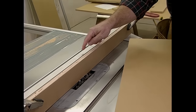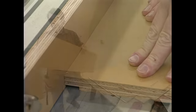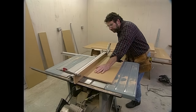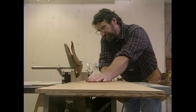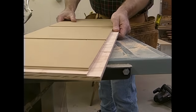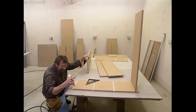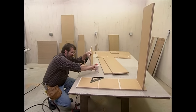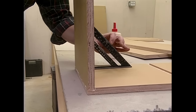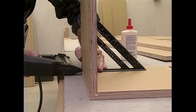Here I'm clamping a sacrificial strip to my rip fence so I can slide it right up to the dado head cutter to make a rabbet for the top shelf. I've raised my dado head to 3/8 of an inch and made the first of two passes to create a rabbet for the plywood back. That second pass completes the rabbet for the back. This quarter-inch groove in the top shelf will receive the plywood back. I'm now ready to assemble one of the upper cabinets — a little bit of glue in the rabbet, bring the piece into place, set it flush with the front, then take a speed square, hold it square to the side, and brad it in place with some one and a quarter brads.